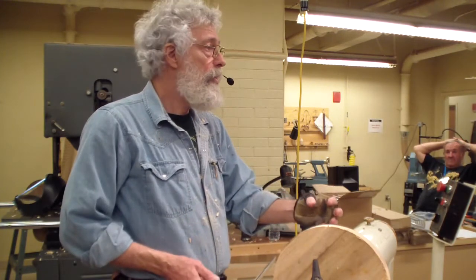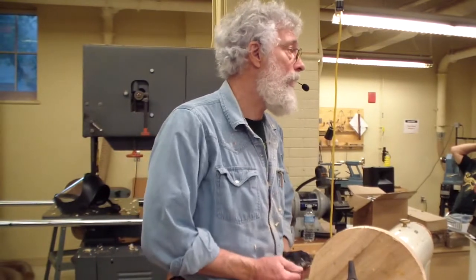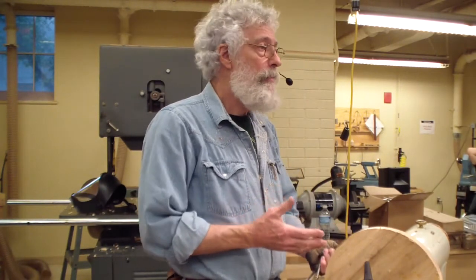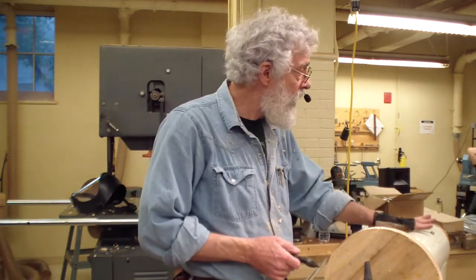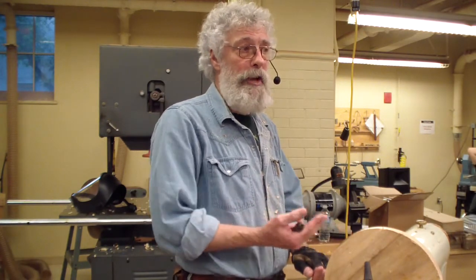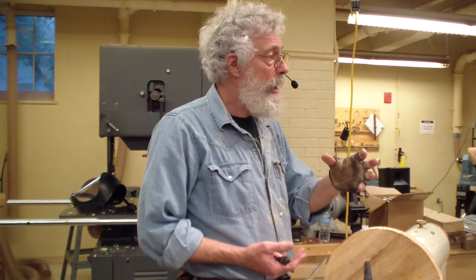The difficulty with the number 2 jaws, outside of the obvious, is that they're too small, is that when you put a real gouge onto the wood and make substantial cuts with it, you're going to snap the spigot right off, if not pull it out of the chuck itself. Plus that, when you get to larger scale, the vibration factor is huge with a small chuck. The idea is you're trying to transfer the mass of the headstock directly to the object without much interruption in order to prevent vibration on the surface of the form. Well, if you can prevent vibration on the surface of your form, you just minimized your sanding by about 50%. So it's worth it going to a larger unit.